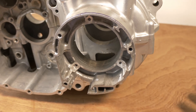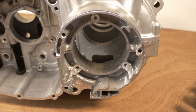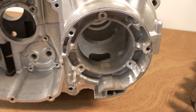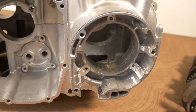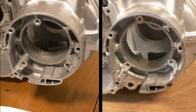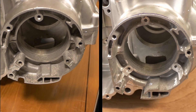Let's take a closer look. You can see the modifications made to the actual crankcase - the three standoffs that normally support the points plate have been completely removed, mostly by drilling and then a bit of grinding, and then the old hacksaw and file method employed to take a chunk out of the bottom of the crankcase itself. This is just to mount an insert that'll hold the crankshaft position sensor.